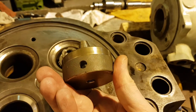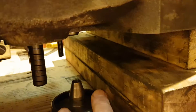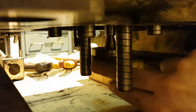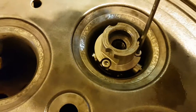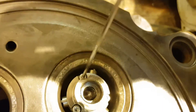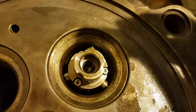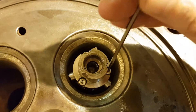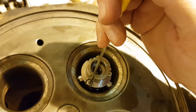Now when the edge is clean, we can insert the pilot spindle. This is the pilot spindle, which has a stabilization support with three pistons. This is the pilot spindle tightening cone — install it from the bottom and tighten by hand. By loosening the locking screws, pistons move outwards and contact the wall. Lock the position with screws. The system is self-centering and there is no need for further adjustments.